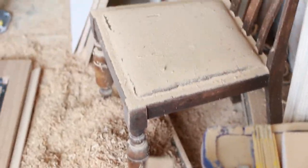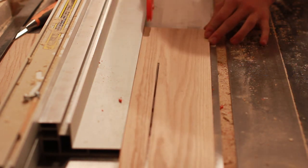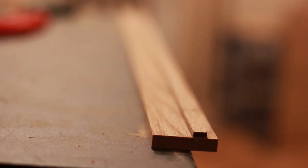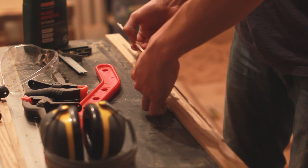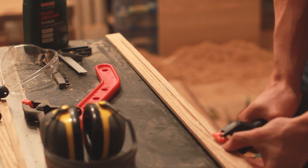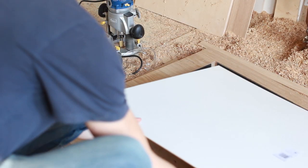To add some strength to the top I've installed some angle iron trim underneath. Unfortunately the depth stop wasn't as solid as I thought and it kept slipping, leaving an ugly mess. I didn't want to hollow the whole area down to the low spots because it had become too thin and weak. To fix the angle iron in place I drilled oversized holes and used big-headed screws to allow for wood movement. To cover up the mess and the angle iron I made some oak trim that goes over the angle iron and holds a hardboard panel painted white — hardboard was used as it's only 3mm thick so it doesn't lose too much depth. The trim is made up of a 35mm wide top piece which covers the bottom of the angle iron and holds the hardboard, plus a 3mm thick strip at the bottom which contacts the underside of the table.